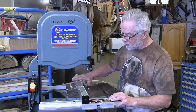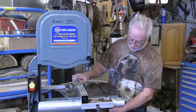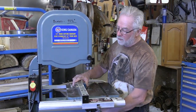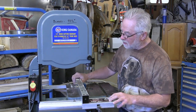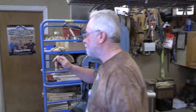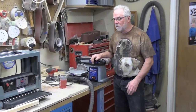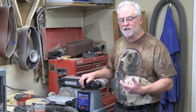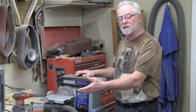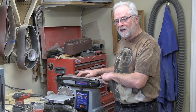The generation of dust is ridiculously heavy with birch, especially once you get down to slat sizes. I strongly suggest getting a shop vac with a hose connection just to keep it away from you and help clean up the mess. Now we're going to go from the bandsaw over to the belt sander. The belt sander is a must when you're truing up the edges of your seasoned wood — you want it smooth, for instance in the gluing session.